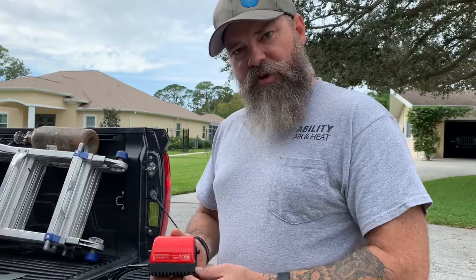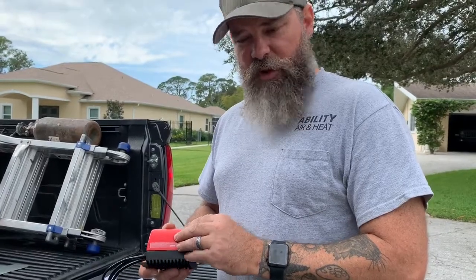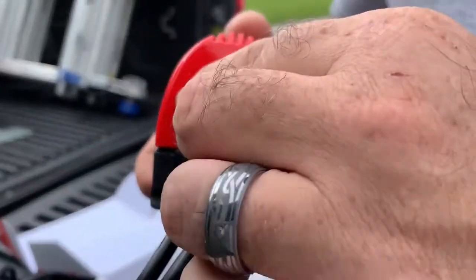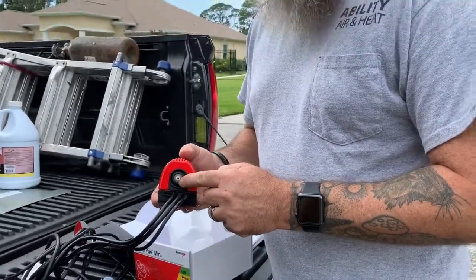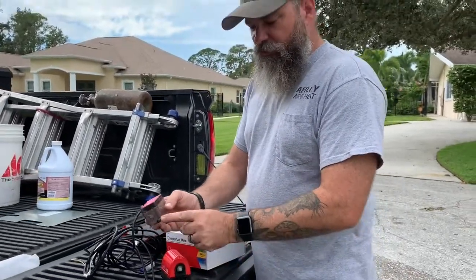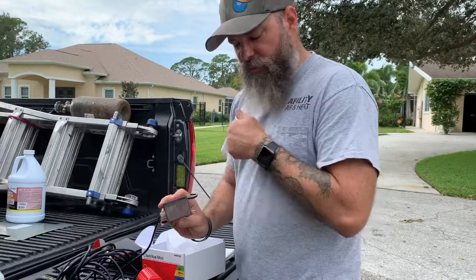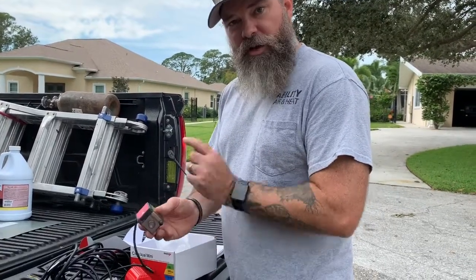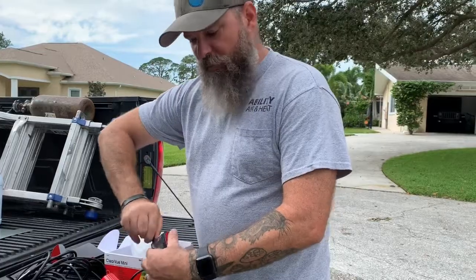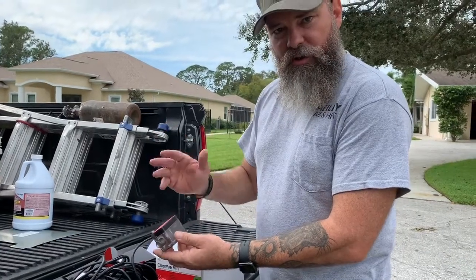Here's your pump. Something very important: I just found out one of these had burned up. Some guys had installed this pump and it burnt up because of these little caps — you need to take those caps off and then hook the nylon tubing up. There are actually two ports, so your nylon tubing can hook to here and then to the pump, or it can hook to the other port depending on which way your nylon tube begins running. In this application we're going to take this cap off and cap the other one, because if you're not using one port you have to cap it otherwise the water will just run out.